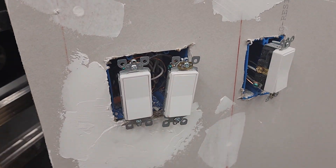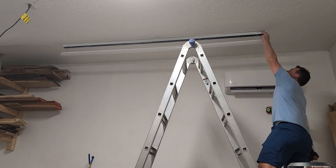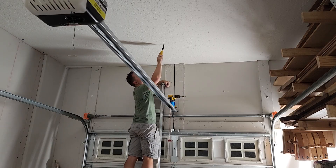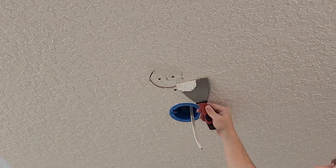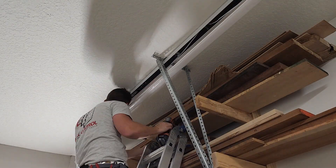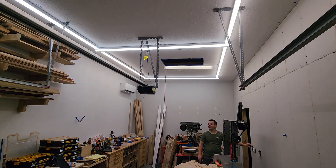The install was a bit challenging mainly because they're eight foot long lights and I'm one person — the ladder had to move around a lot and I needed much longer arms. The length also made it harder to measure the ceiling box locations, so I actually mislocated three of the box holes and had to patch them and cut new holes. I also had to notch out the garage door brackets on the ceiling to mount the lights flush. Once I had all the lights hooked up and working, came the moment of truth when I turned them on. After working for months with a single fluorescent above me, I now had 70,000 lumens of light.